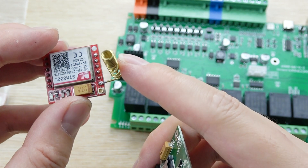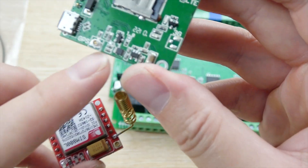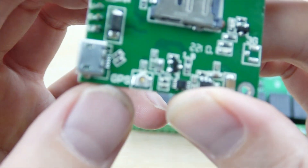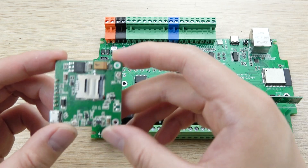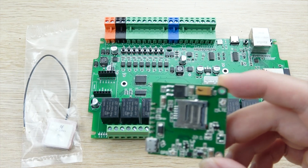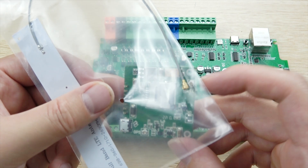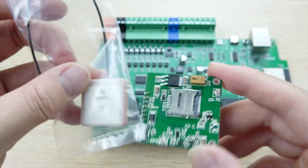This is the antenna — you can use this antenna by soldering it onto this pin, or use an IPX cable connected this way to this socket. This module supports GSM communication and also GPS. Here is the GPS connector, which gives you position information. If you use this module, connect the GPS antenna — one kind of GPS antenna — to this GPS socket, and connect the GSM stick antenna to the GSM socket. That way you can use both the GPS and GSM functions from this module.